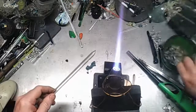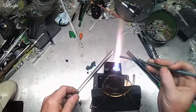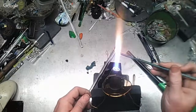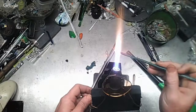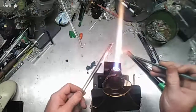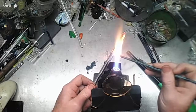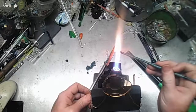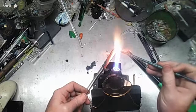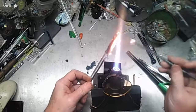Instead of a wet cullet can, I have a dry one. Instead of a wet can to heat and tap off with, I just pull off just enough that I want to do things with and go from there. Again, I'm starting with probably 9.5 heavy wall tubing. What I'm going to do first is add a layer and then encase, but not completely encase. You'll see what I'm going to do as I do it. Like I said, I'm going to duplicate a corkscrew type pattern in tubing, which is pretty cool.